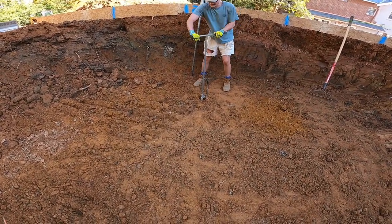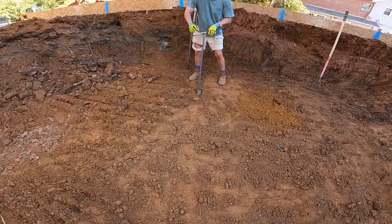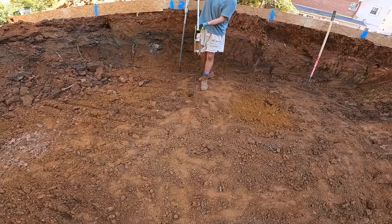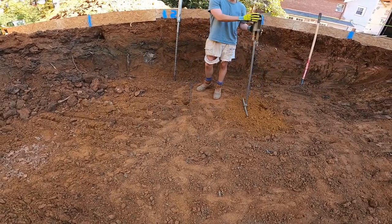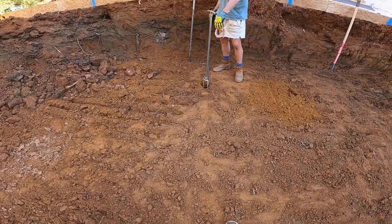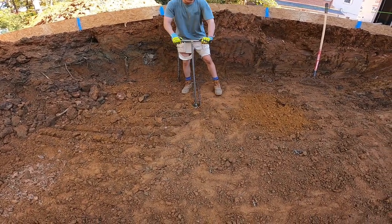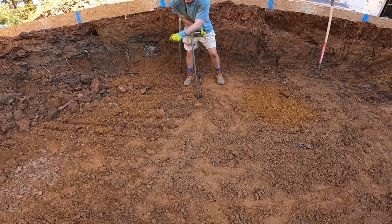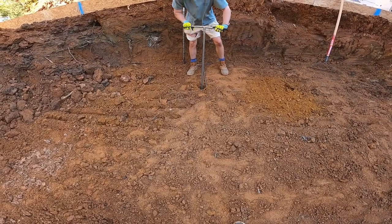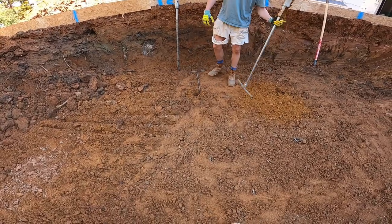If the footings have already been poured, they prep a slab with 57 stone, and we check the below grade wall rebar and stuff like that. We also x-ray concrete walls to make sure they have the right amount and size of rebar. Correct. But then we also have guys on the COT side, and they're more on mass grading projects, like nuclear gauge, asphalt density testing, and mass grading and concrete. We have a lab. Put all your little cores in a cooler, 28 days, and crush them.